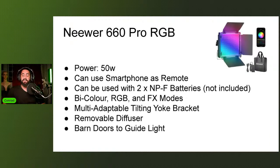So the brightness of each color on an RGB panel will vary, which can impact the overall brightness of the light itself. For example, a green LED may not be as bright as the red ones or the blue ones, etc. So choosing different colors may impact the overall brightness as well. A white LED, as an example, only emits one color of light, and thus you don't need to mix different LED beads whatsoever. So you have a lot more room on a circuit board to mount all of these LED beads, thus you'll get more brightness out of single colored LED panels.